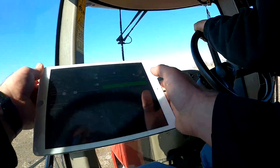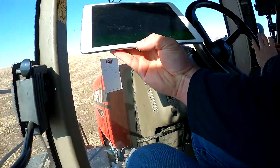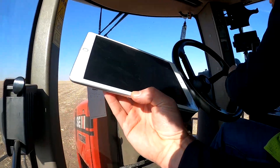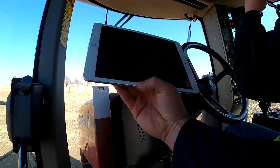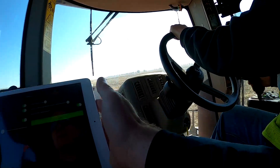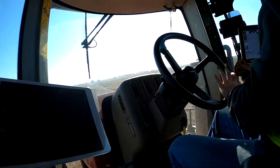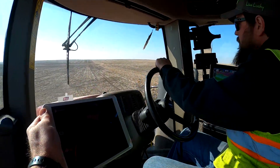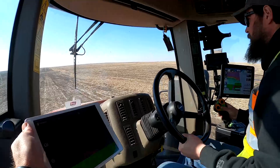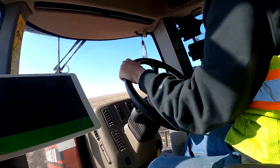It was chirping at me when I turned it off earlier. So that is on. Every time I turn it off, it's going to beep at me. So what's going to happen is when you make a turn, we should set your delay — so your delay is at 15 seconds. You've got your flow at zero. When enough of your runs go blocked, it'll detect that your runs are blocked. It'll show them as not flowing, but it won't alarm you. So we just have to play around with the time so it doesn't annoy you.